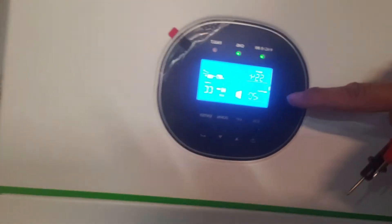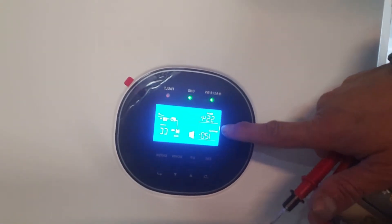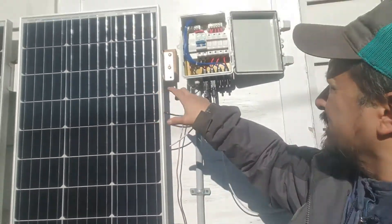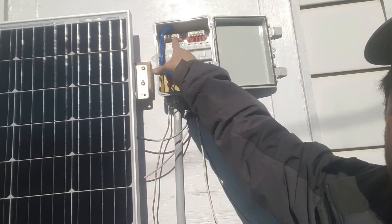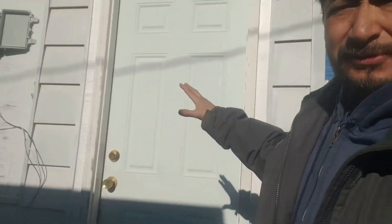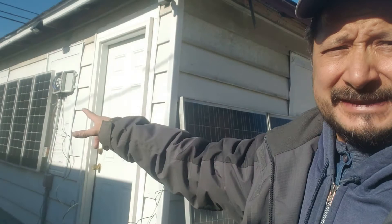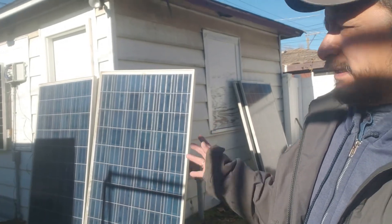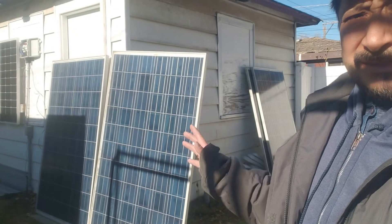Let's go see the Growatt. You see it's 55.4 — the inverter's on, constant charge is on. We're going to see if the 55.4 goes up. Testing the strings after they're connected: the first string is pulling 69 volts in direct sunlight, and the second string is at 56 volts — not direct sunlight. So I'm going to angle these more into the sun and wipe them down. After moving them, they're running at 60 volts now, and I didn't even wipe them down yet. It makes a huge difference if the sun is directly on them, but the carport doesn't allow it — they'd have to be higher off the ground.